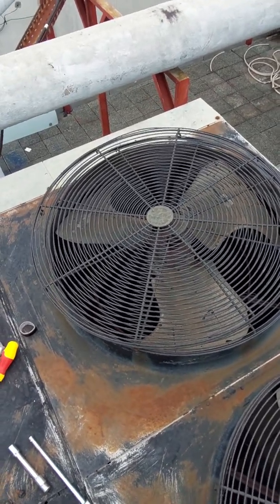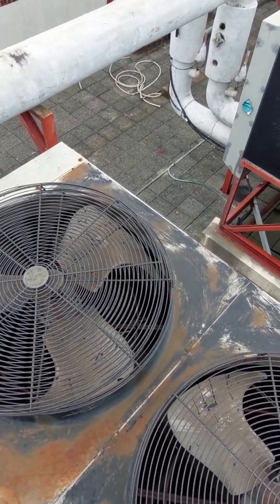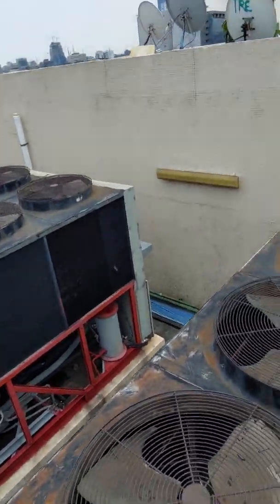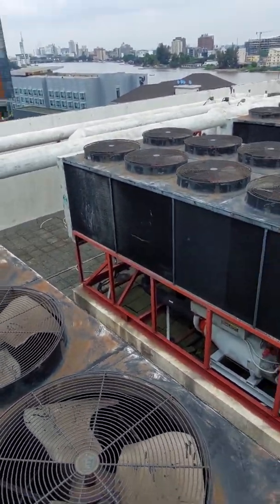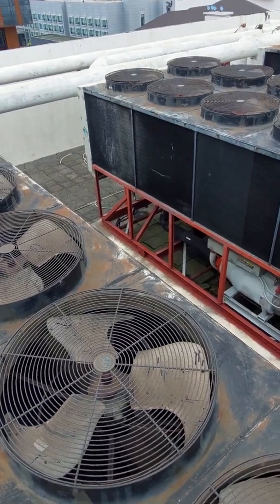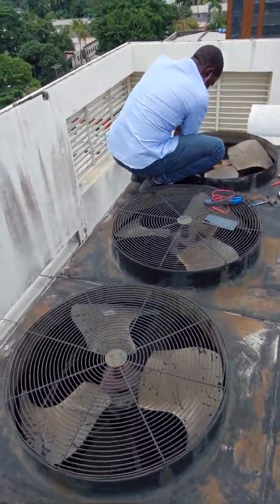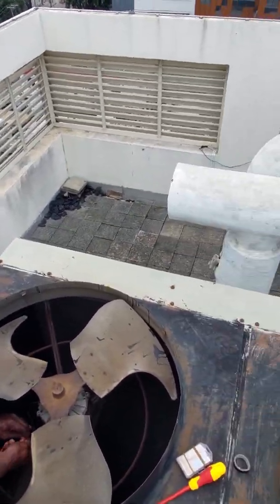It's only circuit one that is running right now. We tried to confirm before placing an order because we don't want to order a part and then not use it. This technician found out that this fan is bad, but we tried to confirm. When we use the meter, it's reading resistance — there is resistance but no ground fault.